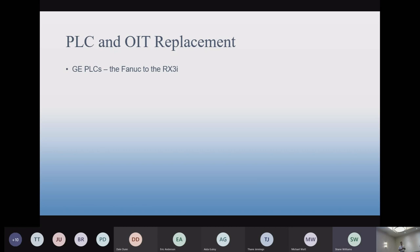Also, on our real view, we have to capture the online and offline temperatures. You can do that. The other thing you can do is lower it so it's still above the offline temperature, so it's still above the acid dew point. So if you've got 350 for your stack online, you can make it 250 or 220 for your offline.